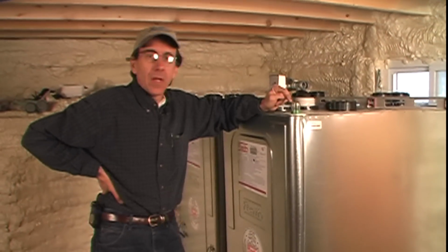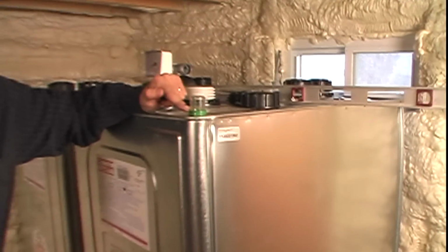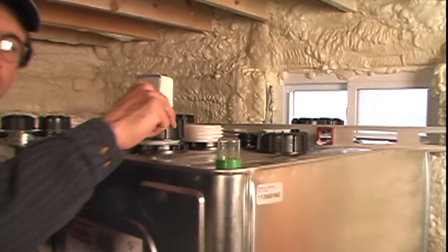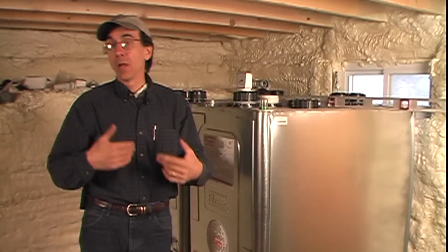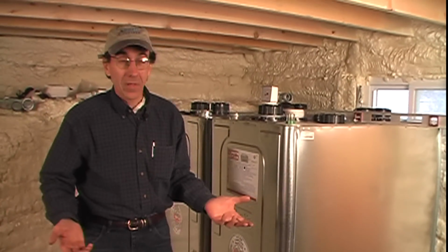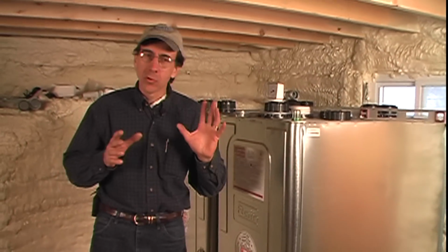What will happen is if the plastic tank ever sprang a leak, which apparently hasn't happened, there's a little pop-up indicator here that would tell you there was a leak. But the leak would be contained. It would be a leak in between the big heavy plastic tank and the outer shell, which is also liquid tight. And you would then know you have to deal with it. You don't have to do that very often, if ever. I don't think they've had any claims, or at least very few claims, in the 20-some years they've been making these tanks overseas. So we've got two Roth oil tanks here.